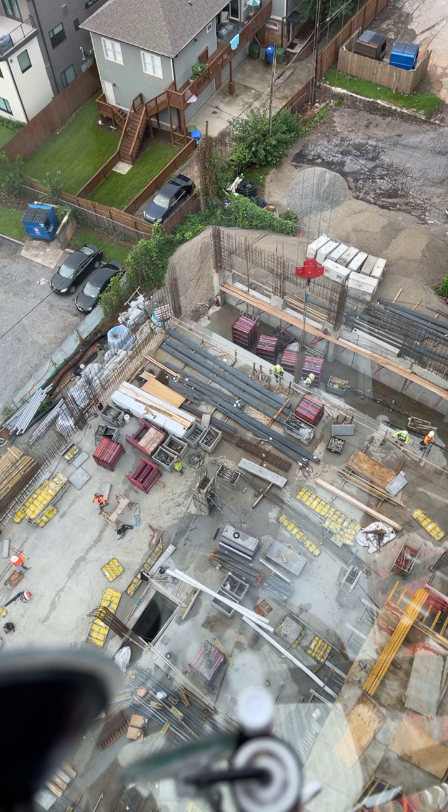Alright, cable up. 10-4. So now I'm going to pull these chokers out. You've got to be real careful doing it so you don't get caught on the column. Alright, you got it. Go for the other column and pull the column back out.